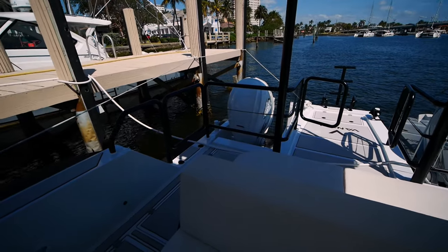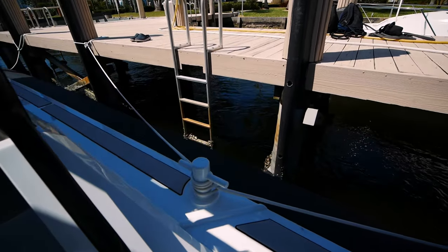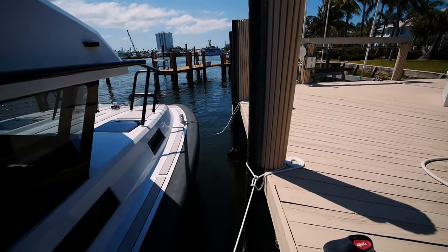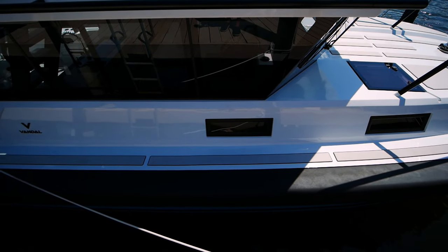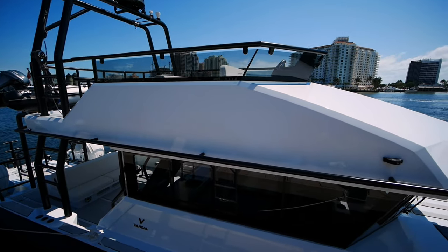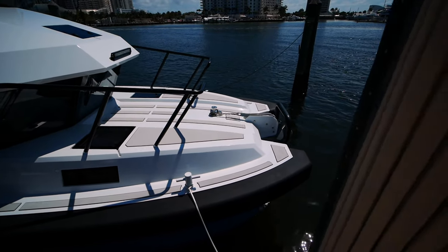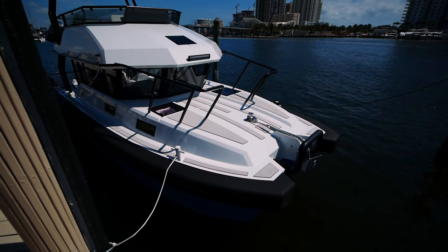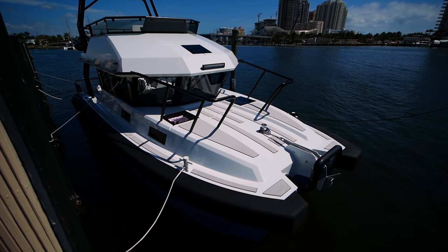As for the actual design, this boat is a foil-assisted catamaran. Some of you may have seen videos from that Swedish company with the boat that fully sticks out of the water — this isn't that. There's an important difference between a pure hydrofoil boat and a foil-assisted boat. The hydrofoil sits between the hulls right about where I'm standing. Unlike some other hydrofoil-assist boats, this hydrofoil was designed to be beachable so you can't really strike it if you hit an object. It doesn't cause the boat to pop out of the water entirely; it just helps the boat rise up a bit to improve fuel efficiency. Pure hydrofoils have been around for a while but haven't become the standard — sometimes a bit less is more.